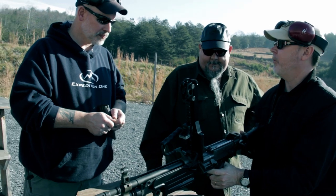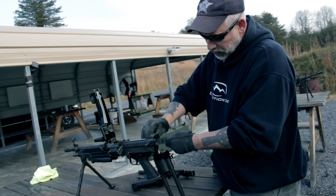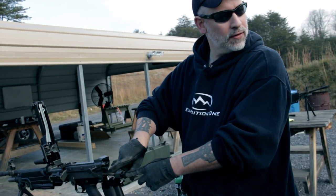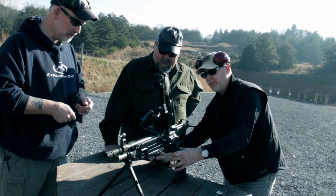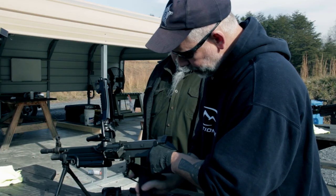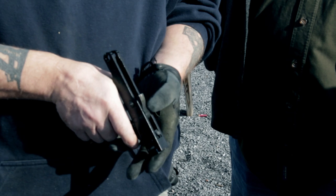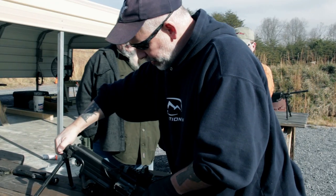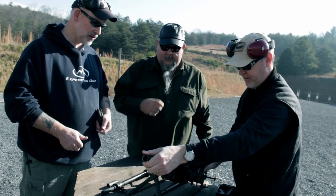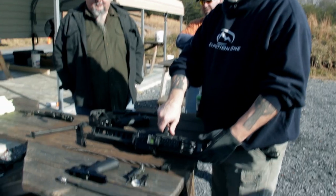Where's your bolt? Right here. Recoil op rod — push in, lift up. It's notched on both sides, so you have your recoil and op rod spring — just like your staple gun. Trigger group, that's all that holds the bolt back. So now the barrel comes off — barrel comes out. Rotate your gas tube, pulls out. That comes off. It's all ready to go.